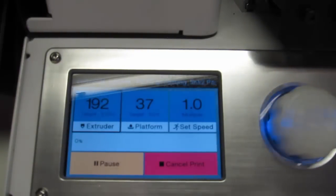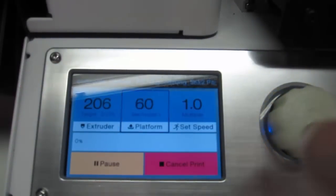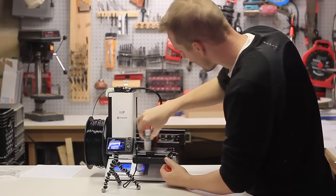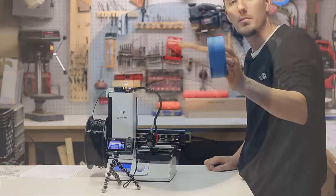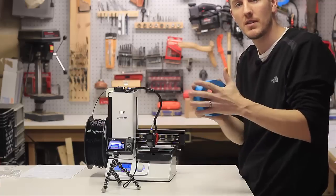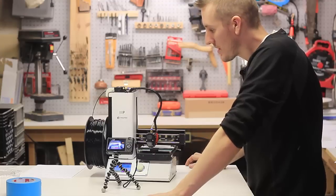You click on a file and it comes to this menu, showing the current extruder temperature is 212 with a target of 210 — that's good. The heated bed target is 60 and it's only at 47. Before starting, I'm going to put a little glue stick down on the print bed. You won't have this problem unless your prints aren't sticking. When you get your printer you'll have white masking tape on it; when that bubbles you'll need to buy a roll of 2-inch wide blue painter's tape. I got one at Harbor Freight for 2 or 3 bucks. With the glass bed I like to use a little glue stick to get that first layer to stick.